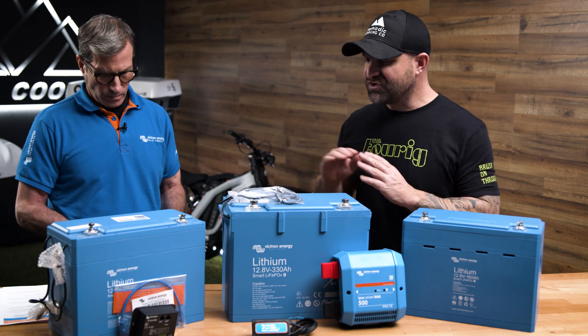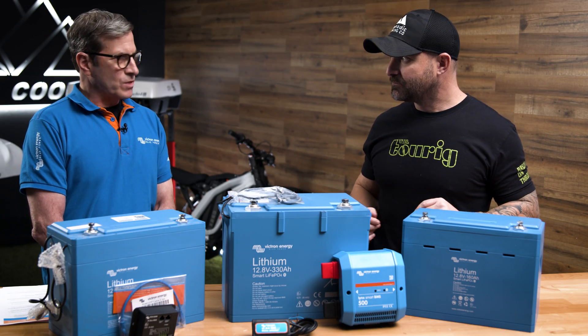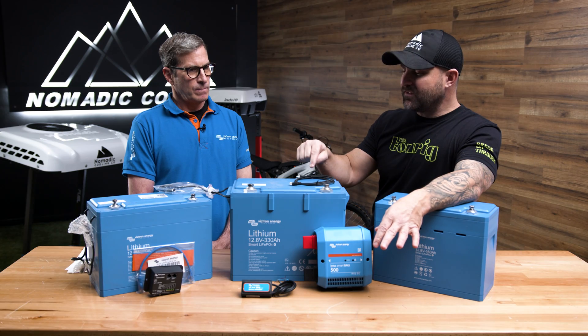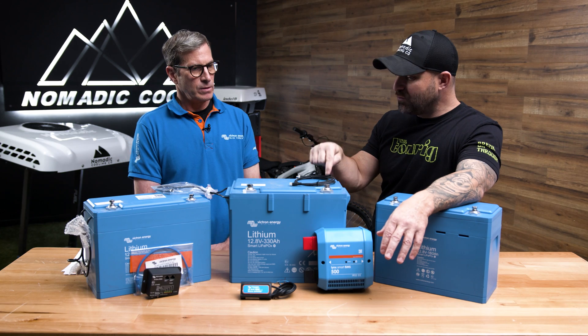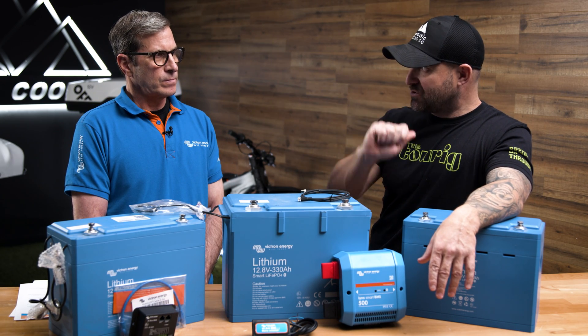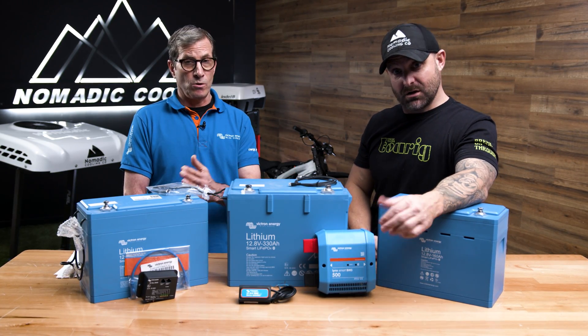You also said you can string these batteries together up to 20 batteries. That's right — the old rule was five. If you have 20 batteries together and one of the cells inside one of the batteries reports a problem, it uses the M8 cable to tell the BMS to stop charging. And it can be triggered by just one cell in the whole string.